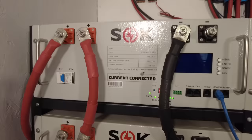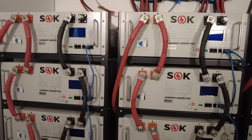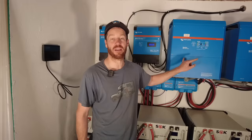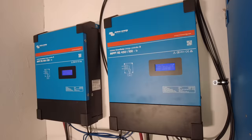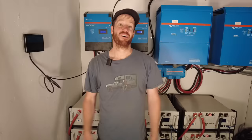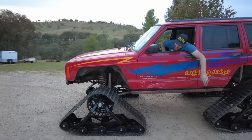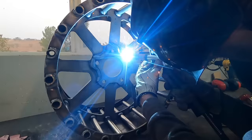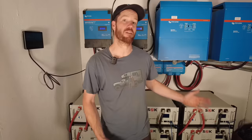Here's the basic rundown of the system. We have 12 of these 5-kilowatt-hour lithium batteries, which gives us a total usable battery storage capacity of 60 kilowatt-hours. We have two 10,000-watt inverters that combine to give us a 240-volt split-phase output. We also have two 100-amp charge controllers for the solar panels. This system actually powers both our apartment and our future workshop. Courtney's passion is in building stuff — we have welders, power tools — and we wanted a system big enough to not limit our ability to make things.